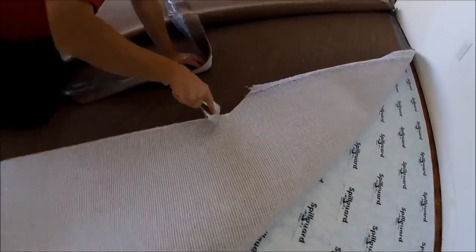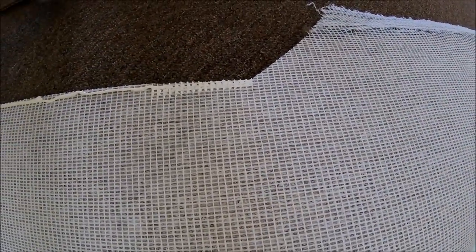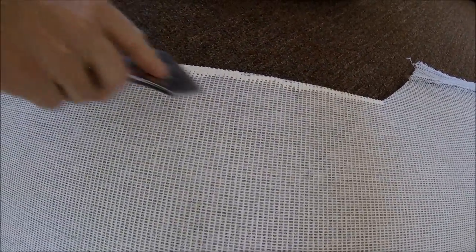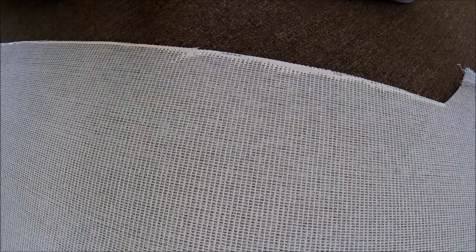So I just take my stair tool. Watch this. Come real close right here. I'm just going to use it like a trowel. See that? And just mash it right in the back of the carpet. That's going to strengthen that up bad. Notice the angle, using it just like a trowel.